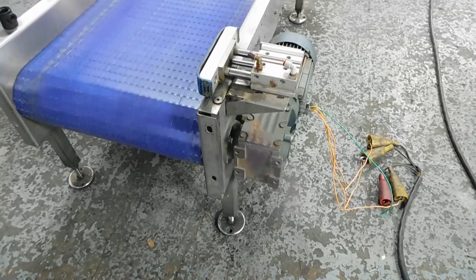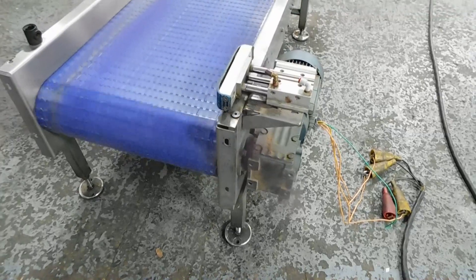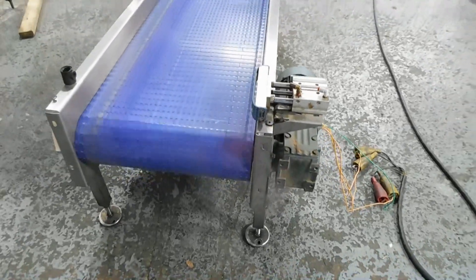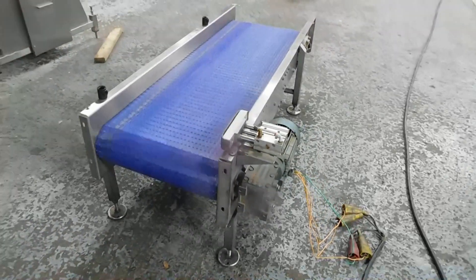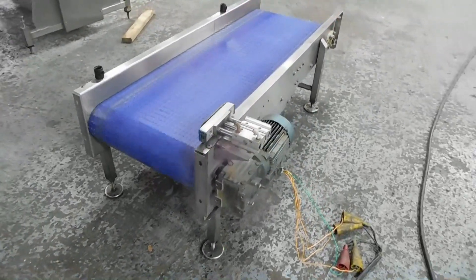Possibly the shaft may have a little bend in it — very slight — that's why it's not running true. It can be corrected or replaced. We have lots of conveyors in our stock, as well as everything in process and packaging.